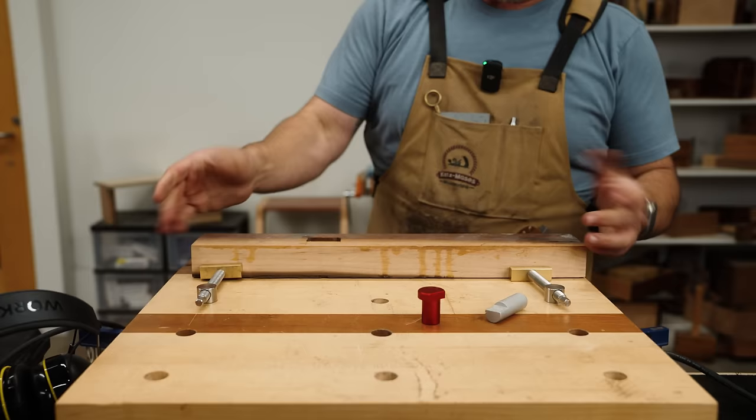There are three important things to remember for use. First and most important: small bites. The smaller the bite, the easier it is to use your router. You never want to go more than the diameter of your bit in depth. The second thing is direction. When you are looking at a picture frame — pretend this is a picture frame — when you are moving on the outside you are going to be going counterclockwise, and on the inside you are going to be going clockwise. The reason for that is the bit is scooping, and that is denoted on the base of your router.